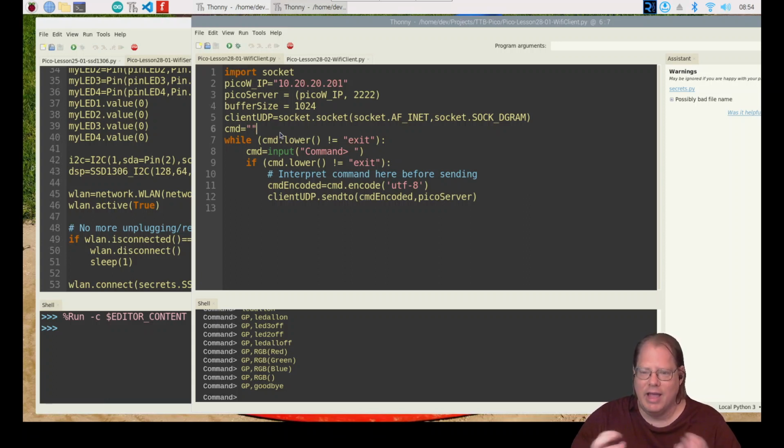So we want to keep the client as minimal as possible. Whatever the user enters, we're just going to literally pass it, and then the server is going to decide what to do with that information. That way, if I had a bad actor on this network trying to use their own client, it wouldn't do anything differently, because I'm just sending literal commands anyway. So I'm just doing my socket, the set IP. The simpler version of the client is just connecting to the Sunfounder Pico at .201.